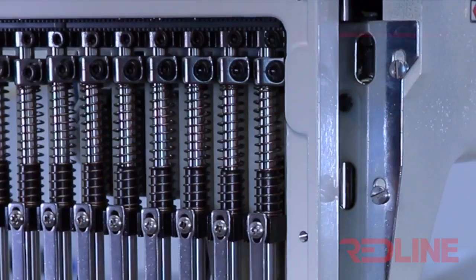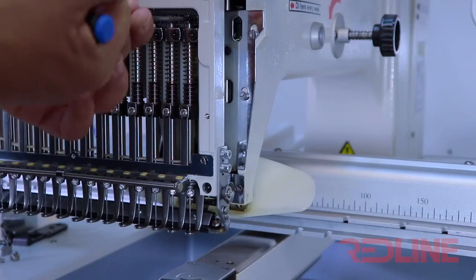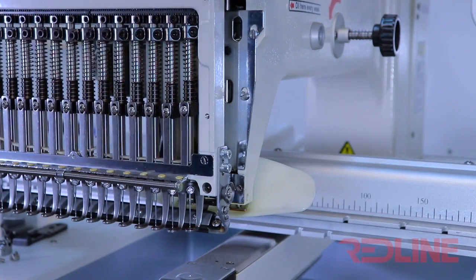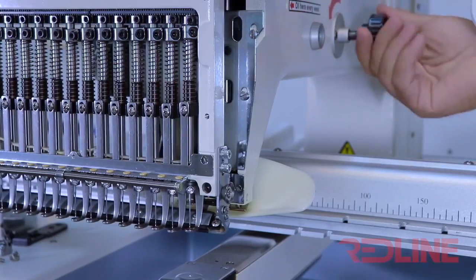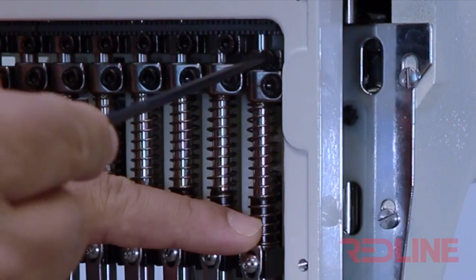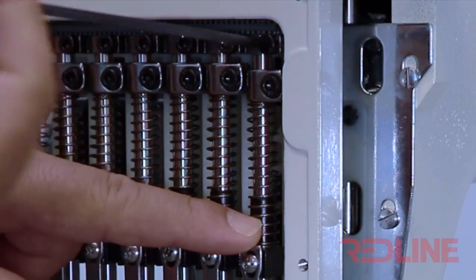In this part of the video, I am going to undo the adjustment of the upper ring so you can see how I readjust it. First I am going to loosen the upper ring — it's completely loose. As you can see, both rings are together. If I try to load the needle, you can see that the needle is not coming down. To readjust the upper ring, I will load the needle a little bit, raise that ring, and tighten the screw.